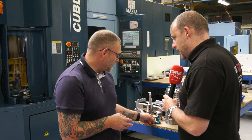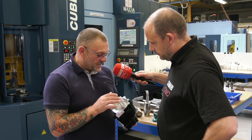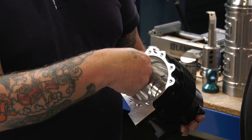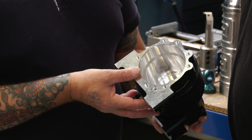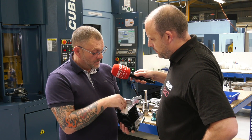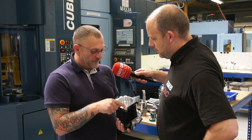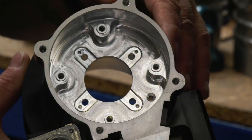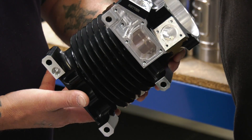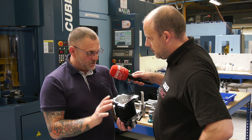This next one — I'm not saying the others haven't impressed me, but this one is certainly something that stands out to me. This part is a cut above the other parts. Again, this can all be produced on a milling machine — there's lots of milling around the exterior. You'd have to bull nose it and spin it round, and you could use boring heads on the inside. But what you won't get on a milling machine is a turn finish across the face. One boring bar that can do the whole lot — absolutely perfect. We don't get the uncertainty on repeatability with four or five boring bars slightly off. It's all concentric, absolutely perfectly round.